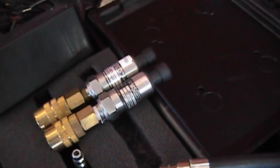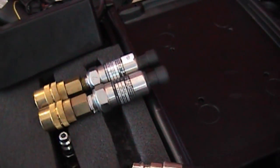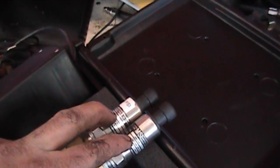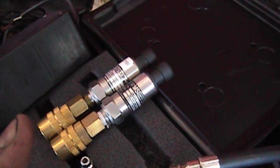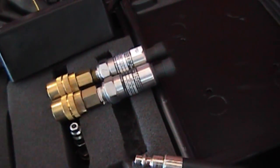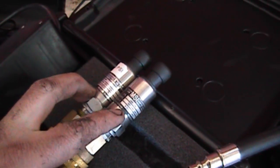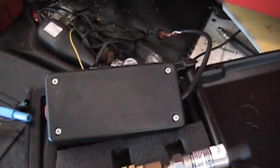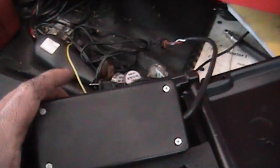You're going to have to do quite a bit of signal conditioning in order to use those pressure transducers. I made real sure that these had voltage outputs — a 1 to 5-volt output, which was linear to the pressure. Inside this box is a 9-volt battery hooked to a 5-volt voltage regulator. You can buy all the parts inside the box for about 10 bucks.